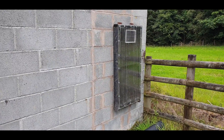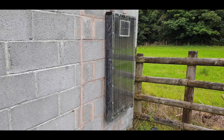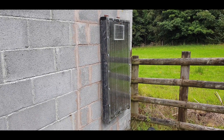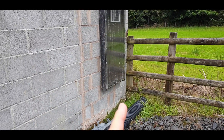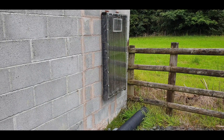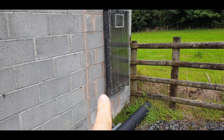This one I made about just under 10 years ago. It's looking a little sorry for itself and I want to try and change the way it's wired up. It's got a temperature sensor in it which doesn't allow the fan to kick in until it gets to a certain temperature, but I want to change that. It sucks air in through the bottom, heats it, and sends it into the shed. I'm going to change it so that it recirculates air from inside the shed - block that off and put a pipe in.